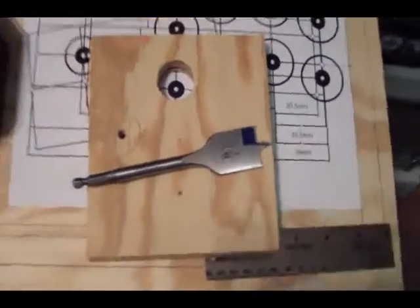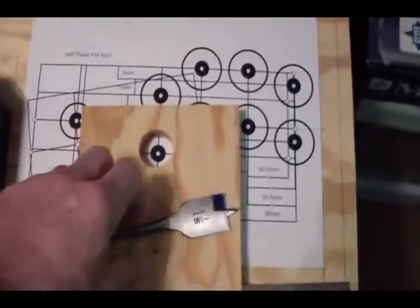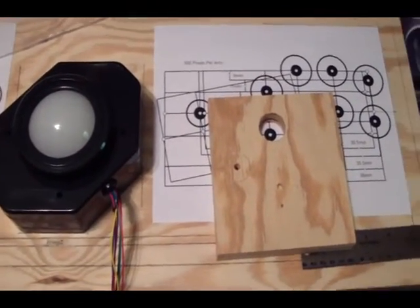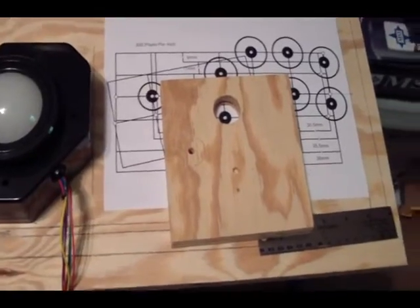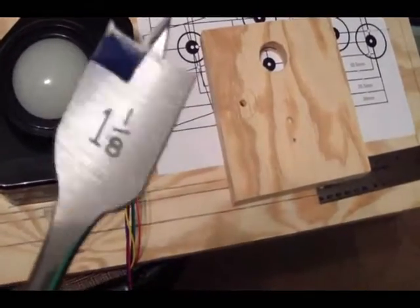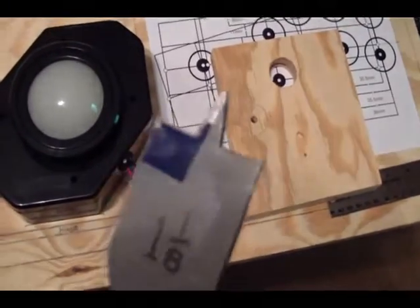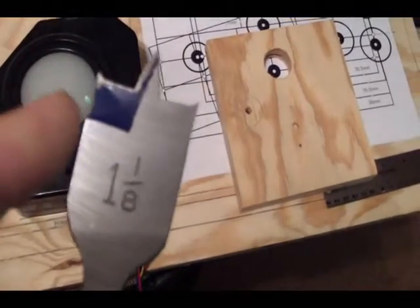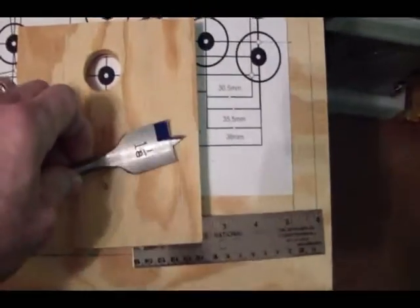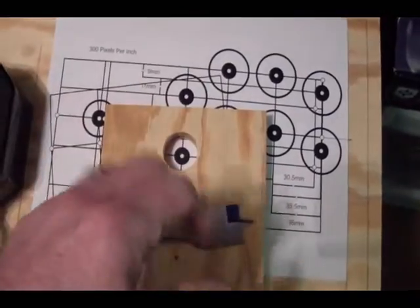That idea came to me driving home from work yesterday. I was thinking about the control panel and how I could guide the bit without a drill press. I realized that if a paddle bit starts its own hole it can wander up, down, left, or right just because of the nature of a paddle bit. So just give it something to hold the edges in place so it can't move, and it forces it to stay on center. As long as we clamp tight enough and the scrap wood doesn't move — we could get a larger piece of plywood to put more clamps on it.